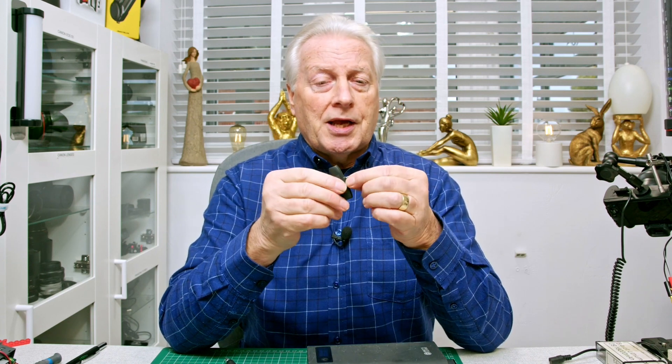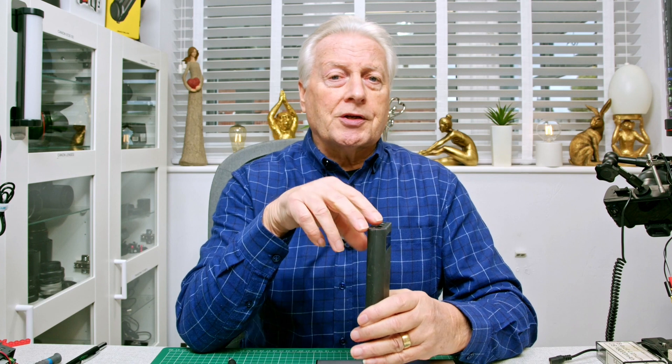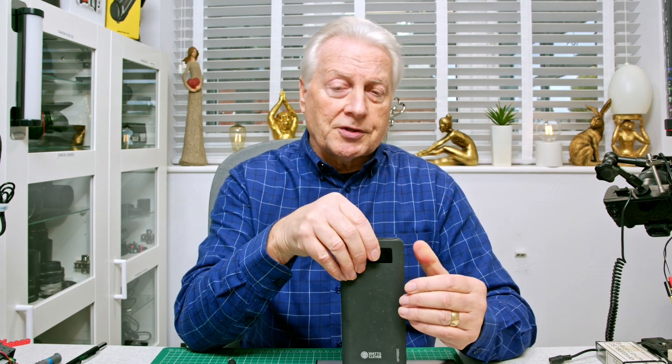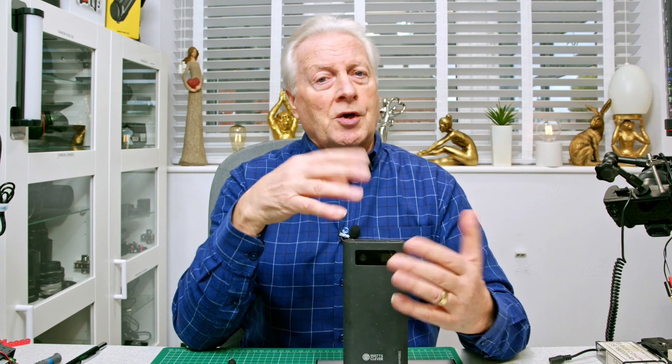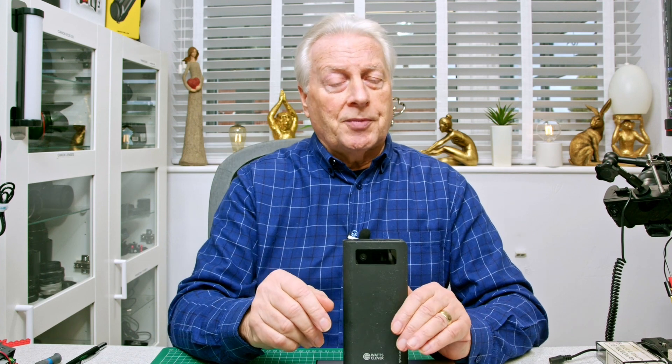The trouble is it would need an external supply to power the receiver up, so I thought I'd use my power banks. But I found that the current draw threshold of some of these larger power banks is about 150 milliamps — meaning I'd need to draw 150 milliamps to keep them on. The manufacturers include these shutdown circuits so that, for example, once your smartphone is fully charged overnight and the current drops below 150 milliamps, the power bank shuts down to protect the battery. But this doesn't help us if we have low current devices which would cause a shutdown after a short period.